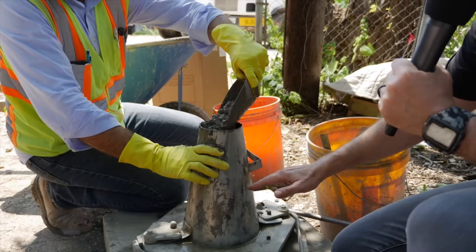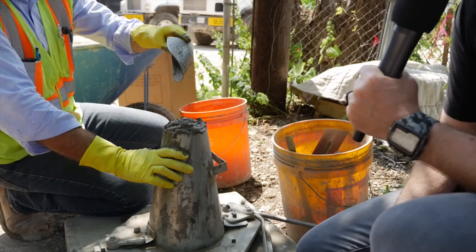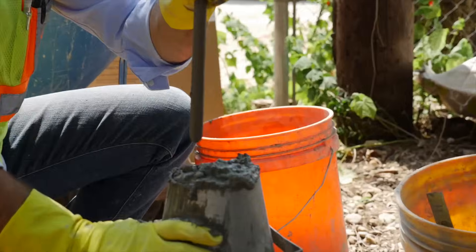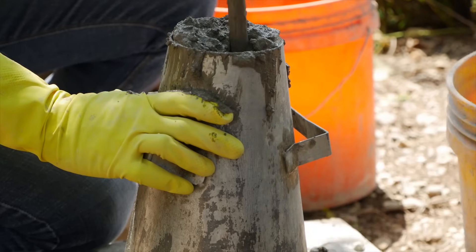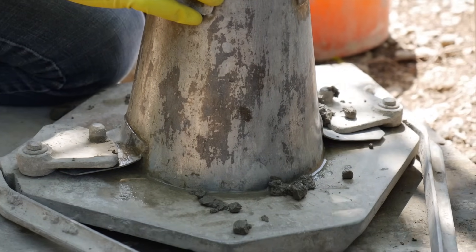You can see he's doing this in lifts — about three or four lifts — and each time he's using a piece of rebar. He's got a fancy rod here, but you could use a piece of rebar to do this. We're making sure all the air is out; you can see some bubbles coming out of the bottom, making sure that concrete's in there nice and good. Then he's going to level it off in a second here and pull this out.